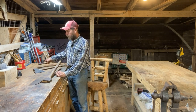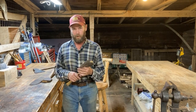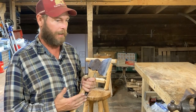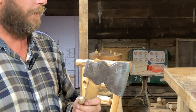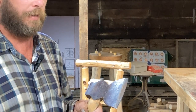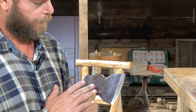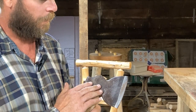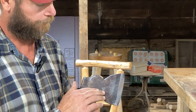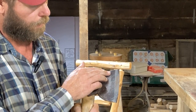What I like to look for when buying antique edge tools — I prefer forged tools to begin with, as opposed to a cast tool. Even though they've been experimenting with casting better qualities of steel and even casting tool steels, and some of those cast tools can rival a forged tool, but I'm a traditionalist, I just prefer the forged tool. You can tell this is a forged tool by the hammer marks, for one thing.